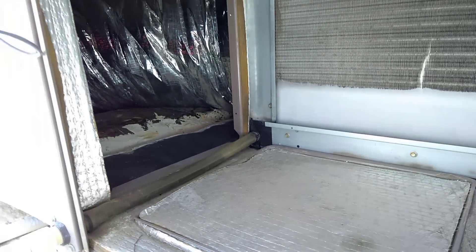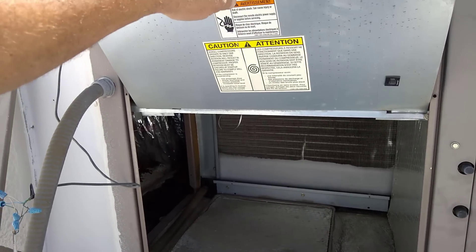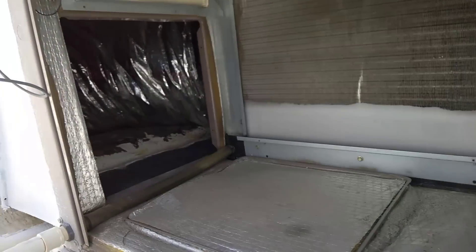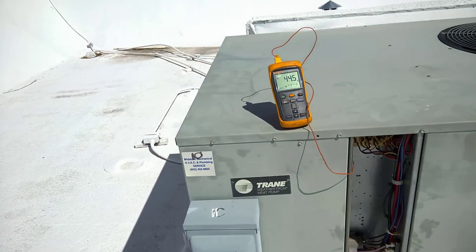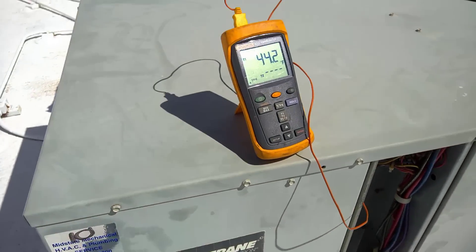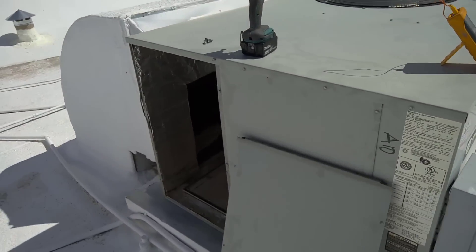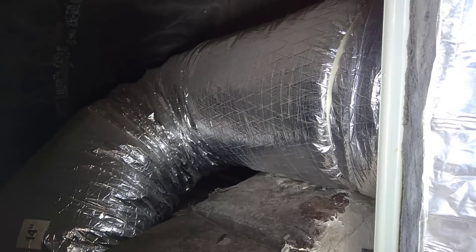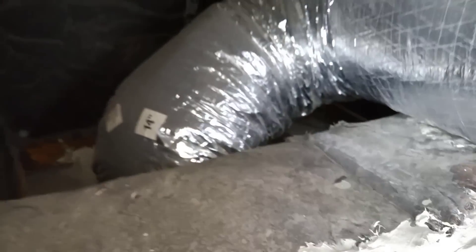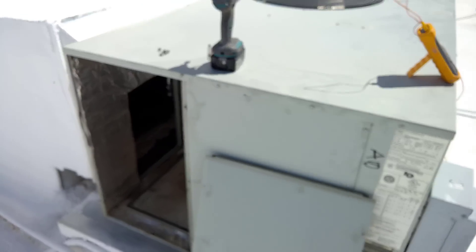For the return, you know, with less velocity through duct work you usually need a larger size — everybody knows that. But the plenum area is mostly filled with that large supply flex duct, so there's not much room for the return. Same thing with this unit. That's probably 44 degrees supply — 44, 43 degrees supply temperature on this sucker. Look at that — that's the supply dropping down the same duct as the return. That flex duct is taking most of the area. Pretty much doomed from the beginning.